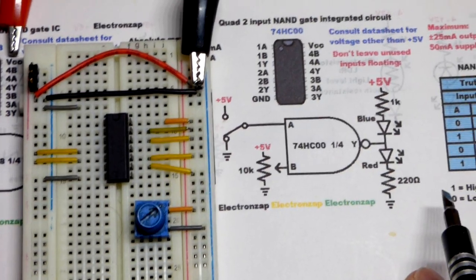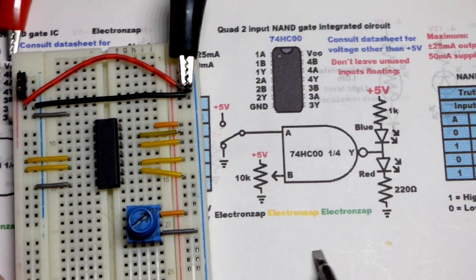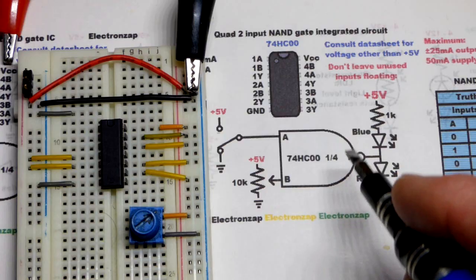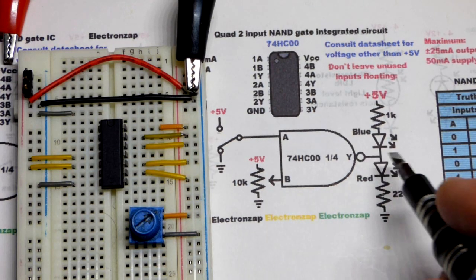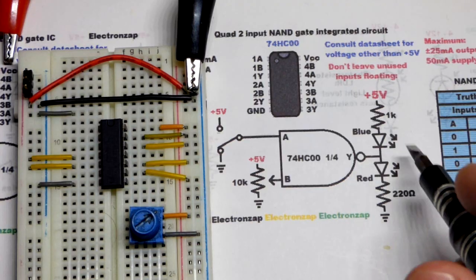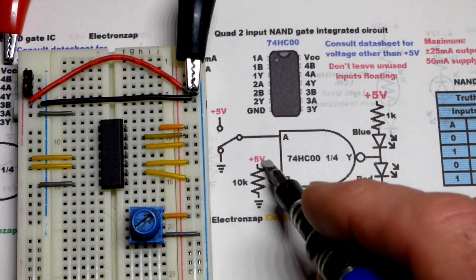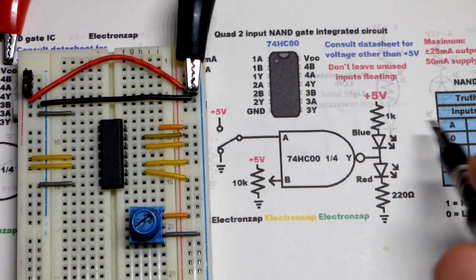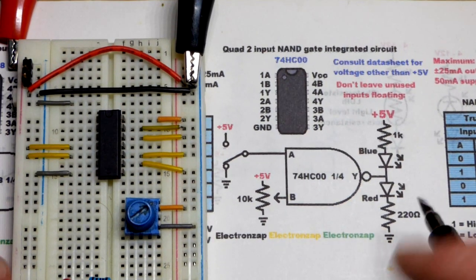You've essentially made a NOT gate. You can also combine NAND gates to make an AND gate: take a NAND gate and follow it with another NAND gate with its inputs tied together. That second gate inverts the output, so if the first gives you a high, the second gives a low — effectively an AND gate output. It's a very versatile logic gate.